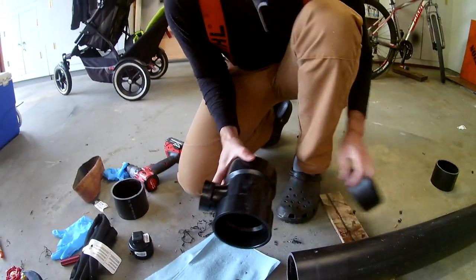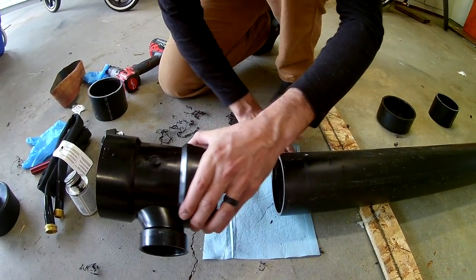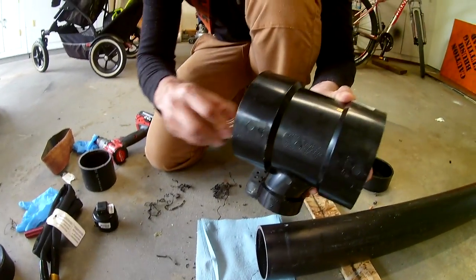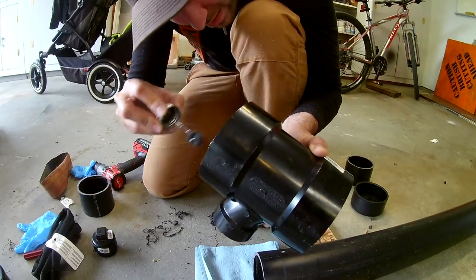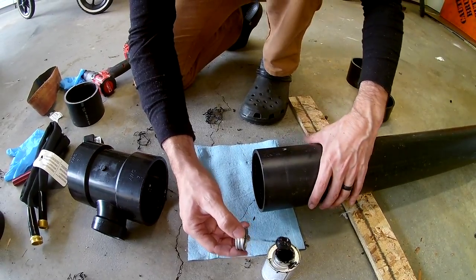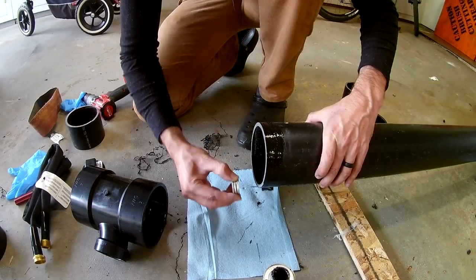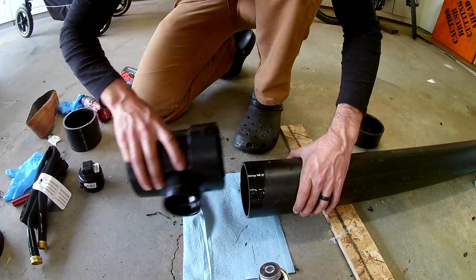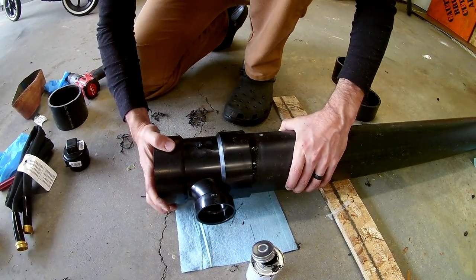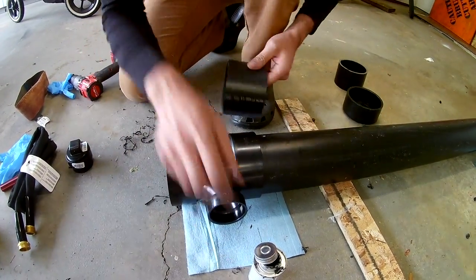Now I'm going to glue on the water fill hole. When applying ABS cement, make sure you get it all the way around both sides of the fitting — both pieces need lots of ABS cement. If it drips, it's okay, we're not professionals here. It's better to have too much than not enough. If you watch closely, I put cement on one piece but forgot the other — it ended up fighting me when I tried sliding them together. Luckily it held fine; I had 80 PSI in there later and it was good.